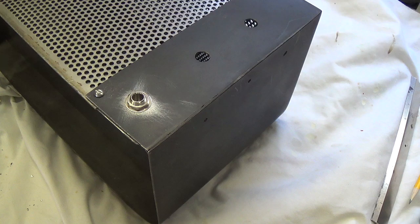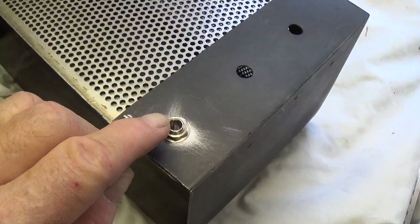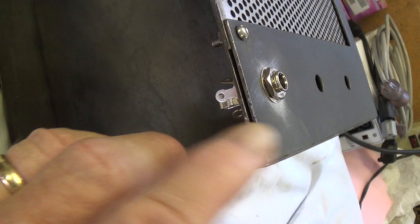I finally resolved the issue of where to put the input jack. I decided to put it back here at the bottom of the cabinet, right in line with the four and eight ohm speaker output jacks. The input here keeps me from having to drill on the side and detracting from those nice sweep-around aluminum trim bars, and it provides some nice shielding on at least three sides with the metal cabinet and the steel chassis body.